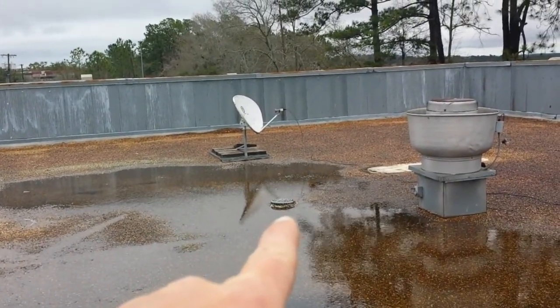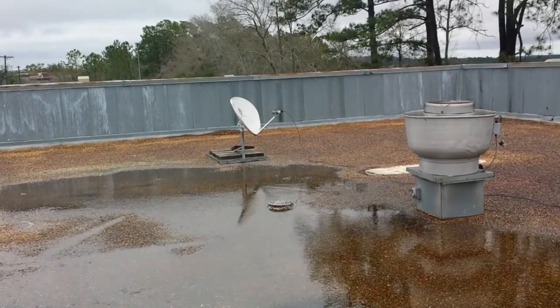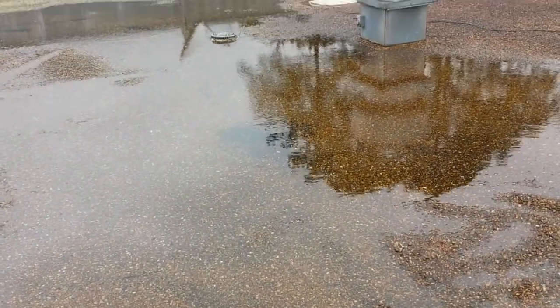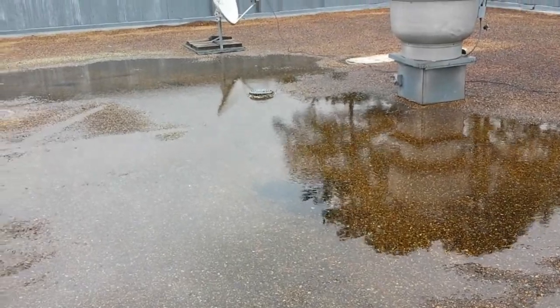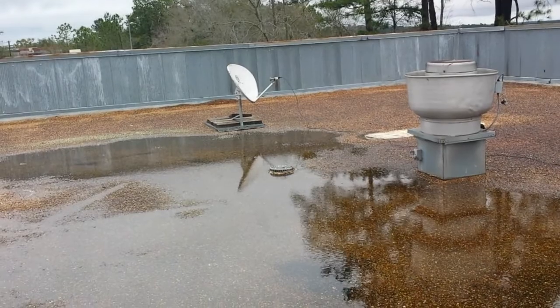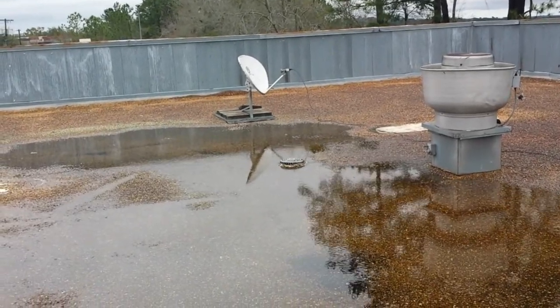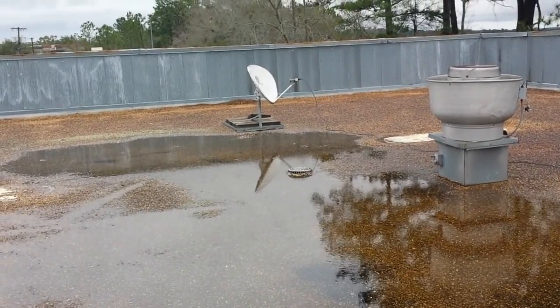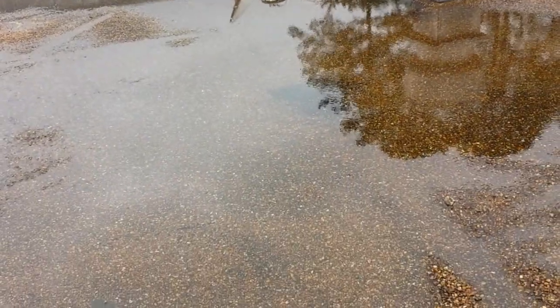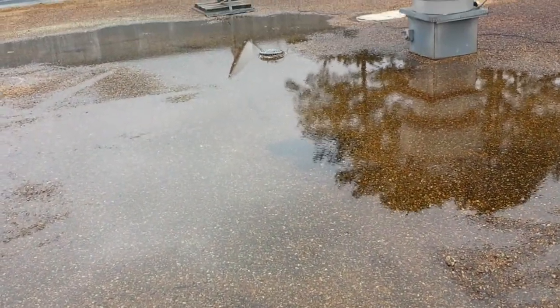All that is just a little bit of pine straw and debris. When I get rid of that, it's going to take a tremendous amount of this water and weight off this roof. It's very imperative we keep these drains clean on these roofs — I can't express that enough. Without those drains being clear and open, water has nowhere to go other than straight down. That's a tremendous amount of weight right there.